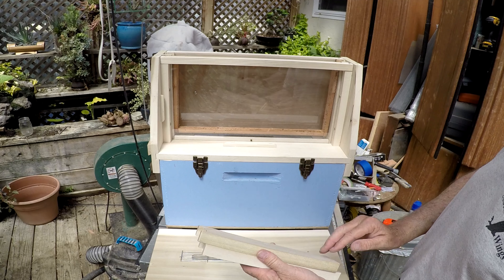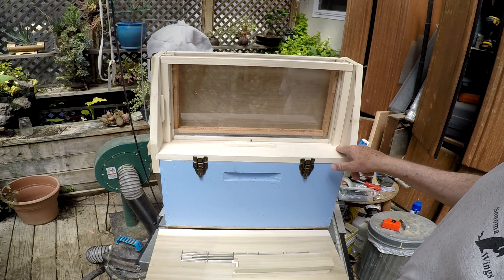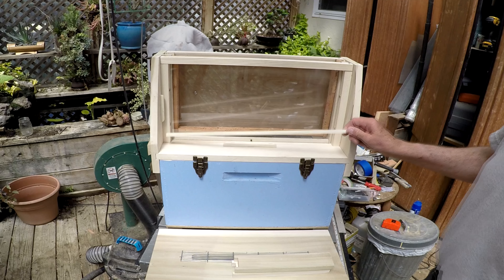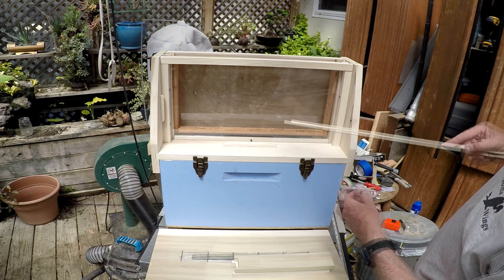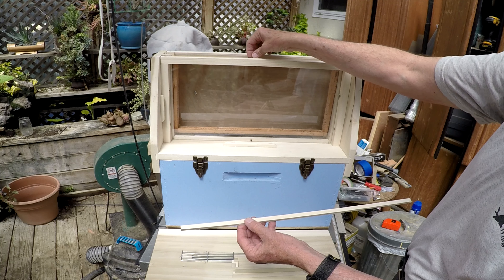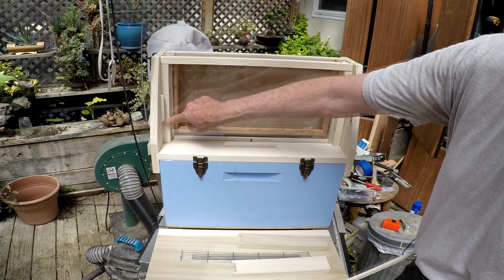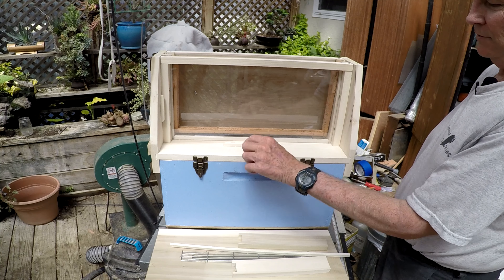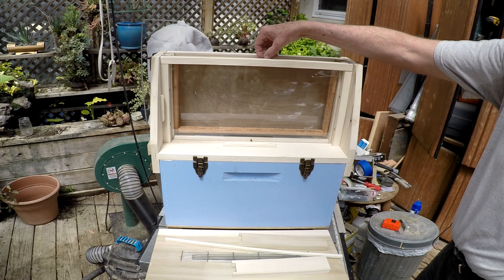These two face cover pieces slide in, you have the piece of plywood on the backs of those, and then there are frames up and down that hold in the plastic. There's also a little piece here — this one's too long, you have to cut it to length — and that goes inside and is what your plastic rests against across the bottom. It's floppy on the top, but there's a screw you drill in to hold the plastic so it doesn't accidentally fall out.